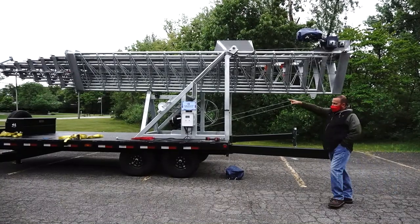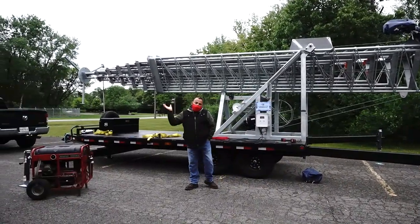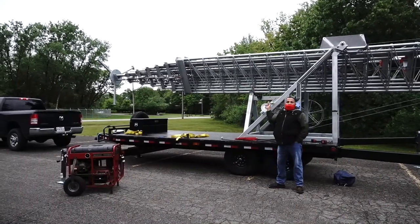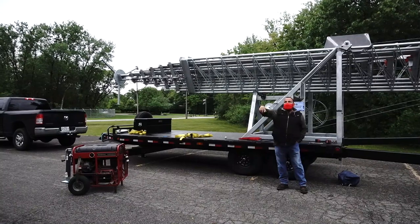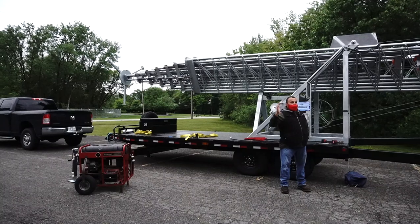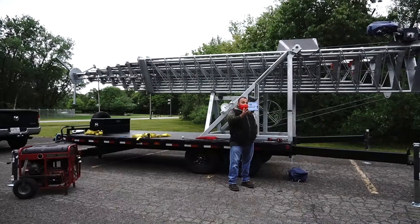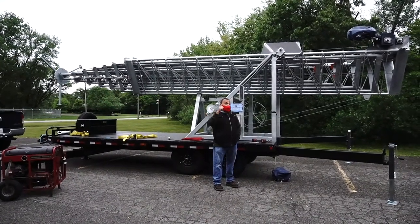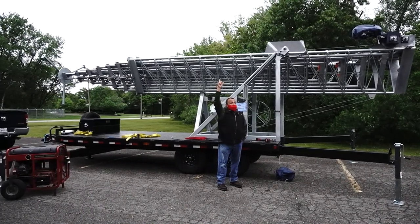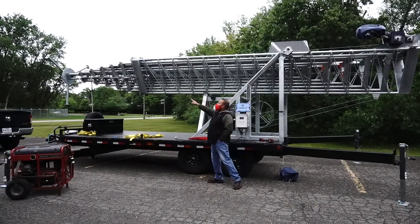We're talking about the rings. We install the rings there for all your cables, fiber optic, coax, coming inside, because when you have the tower at 120 and it's windy, it's really bad, the cable does this. So the rings help you to prevent damage to your tower and protect your equipment. Every hit on the tower moves your equipment, okay? So that's why we put that one.